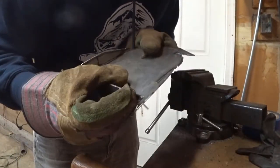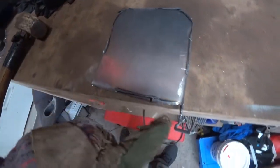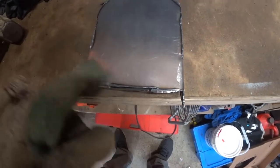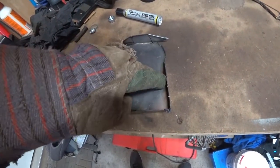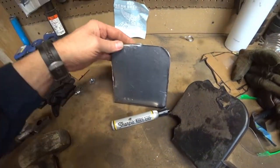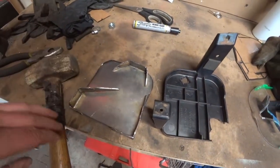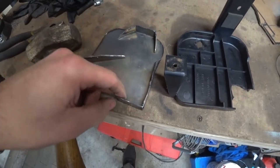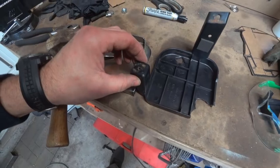This corner I didn't notch out correctly, so I've got to trim it back. I'm going to clean this up so it looks a little bit better. All in all it's coming out okay — definitely not as pretty as I was hoping but it is what it is. I'm going to bend these tabs under, get those set, then do some more grinding and cleaning up. The top of this thing is pretty much done. I still have to bend this one back in as a little support, and then I can start worrying about the legs.